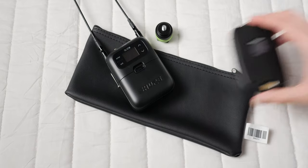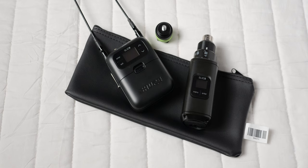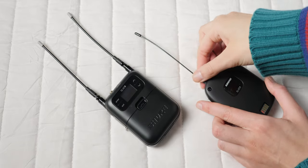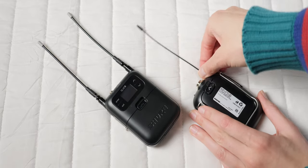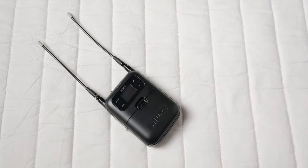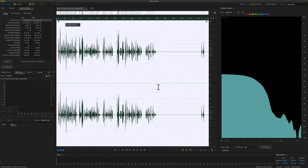You can get a $729 USD kit which includes the receiver and the plug-on transmitter — a great option if you need a wireless boom or handheld microphone. On the cons side: there are no SMA connectors on the receiver or transmitter, so you can't swap out the antennas and cannot use external antennas for the portable receiver. On the rack mount receivers, you actually can connect external antennas.